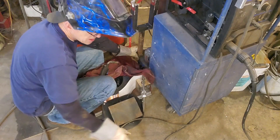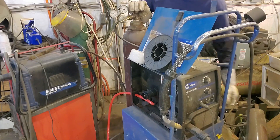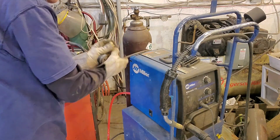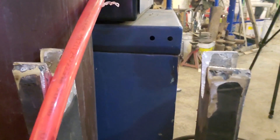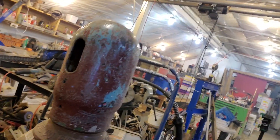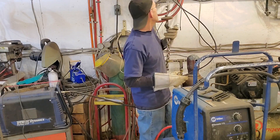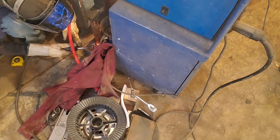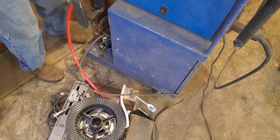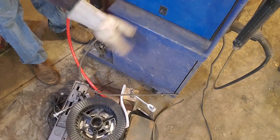She's close — I gotta move it over, it's just not centered enough. Move this sucker over, move the tank over. Gonna have to lift it with the crane. Here's the problem: even if it's in there, between here and here is where the spool goes, and it needs to go through that pipe — so it's gonna be too far to one side. I'm gonna move the argon tank as far as I can. We got her welded on.